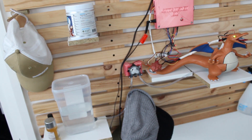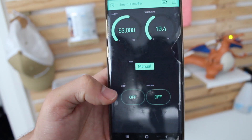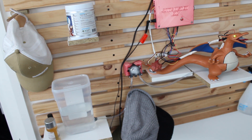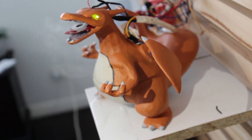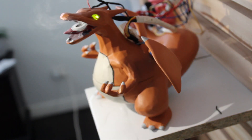What I'm showing you now is the device running in auto mode when the humidity is less than 80%. A final fail-safe is to make sure the pump works within its own cutout time — the pump will run for a certain amount of time before the LED lights start flashing, indicating the diffuser is full and the pump will now cut out. If you enjoyed this video please hit the thumbs up button, leave a comment, and subscribe to our channel. If this was a project you genuinely enjoyed, please comment below on how you would have approached it and what other projects you would like to see. Until next time.